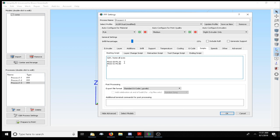So then, to save this, or to set this as an extruder, we type M164, S for set, 2. So now we've taken a 20% mix of tool 0 and an 80% mix of tool 1, and we've saved it as a virtual tool, which will be called tool 2. So that's all we have to do. It's all set to go.